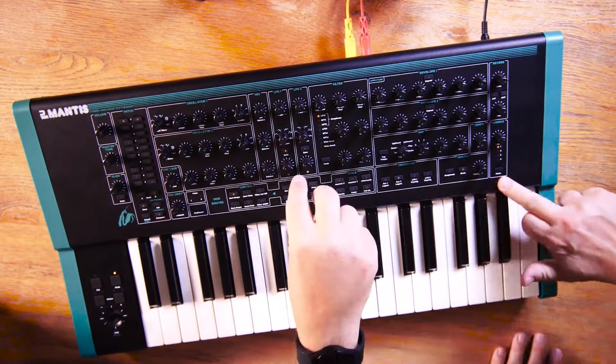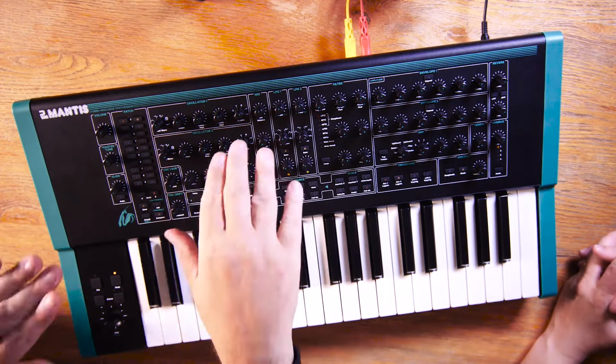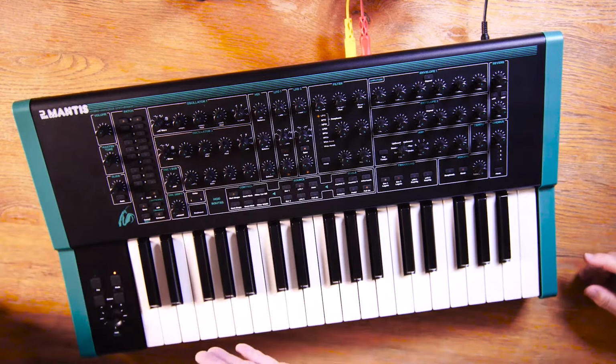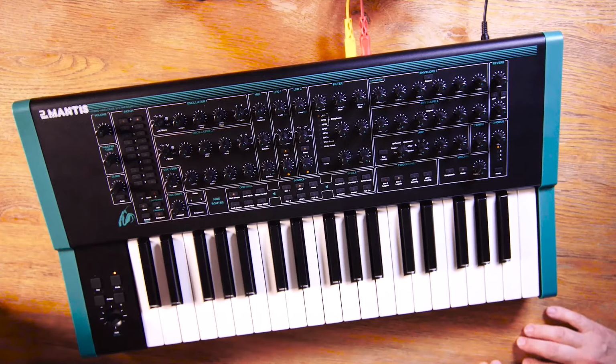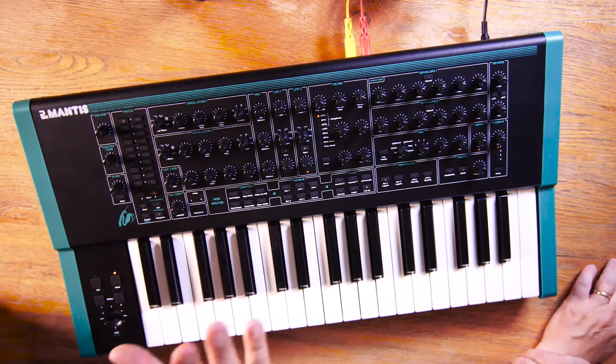So when they're synced, it's just time divisions of an incoming clock. Correct. And it auto detects clock. It does. So if you press sync now and you're using the ARP, they'll sync to the ARP. If you throw clock at it through its MIDI clock, which will receive through the standard MIDI DIN or through the USB, then it will just detect that and start going. And if you throw two at it, you can't confuse it. It'll just take the first one. Yeah, and there's like a timeout before it drops that one and picks up another one. That's cool. USB-C as well, isn't it?